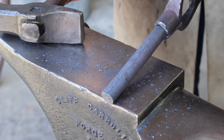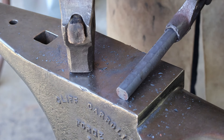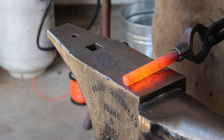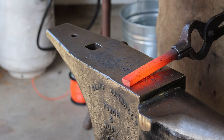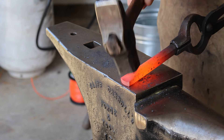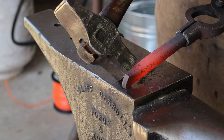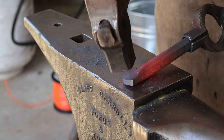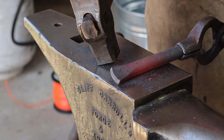Now that I've got the flats fully established on two sides, I'm going to flip that 90 degrees and start forging this down to spread the tip of the actual chisel and establish that shape, then blend that up the body of the chisel. I am keeping my left hand elevated as I'm hammering down on this tip so that I get a similar angle on the back side of this taper. Otherwise this whole thing would end up kicked off to one side, which is why I keep swapping sides — hammering down for a while, then swapping to the other side to ensure even pressure and even spreading on both sides.